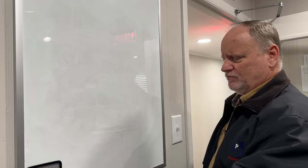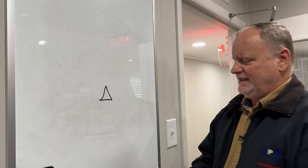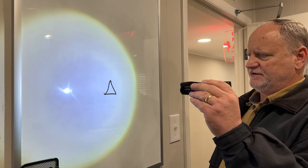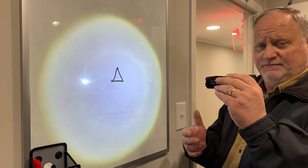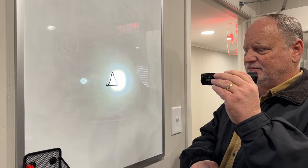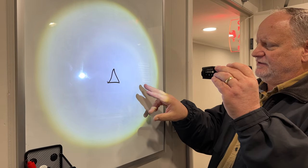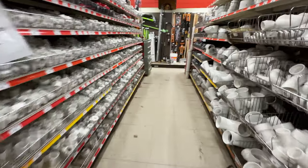We know what tower we're going to hit — it's about 50-60 miles away. With a three element antenna the beam is wider, so you have room to play; even if you're pointing a little off, you'll still hit the target. But a seven element antenna makes the beam much narrower, focusing all of that signal straight into that tower. You don't have a lot of room to play with, but once it's locked down it'll be good. With the narrower beam, you're not wasting RF — your signal is fully focused.